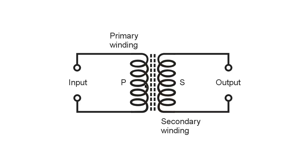Here's the general generic diagram of the transformer. The primary winding is where the input goes; the secondary winding is where you take the output from. P represents the number of turns in the primary and S represents the number of turns in the secondary. Z-IN is your input impedance — that's the device, the microphone, whatever — and Z-OUT is the output impedance. These must both be pure resistances, meaning the devices can't exhibit any reactance.